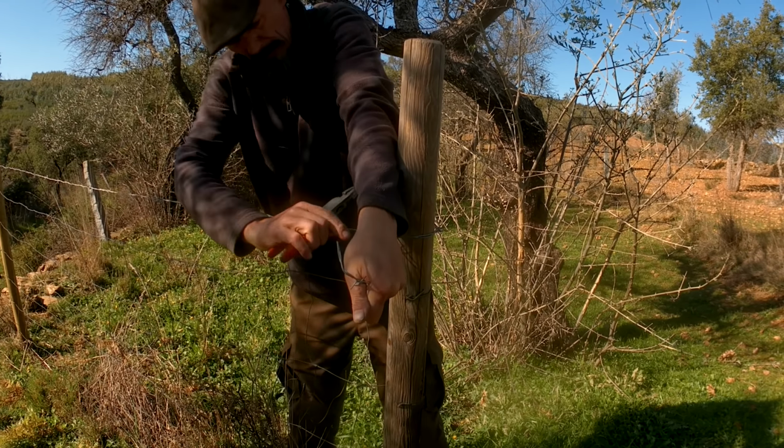When you put your staples in, don't put them in vertically, put them in at an angle, because then you won't split the grain of the wood with two nails going in the same crack. You bridge them across the different pieces of wood.